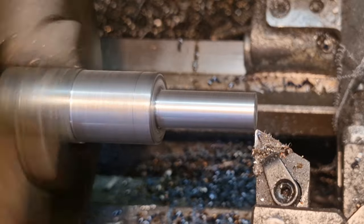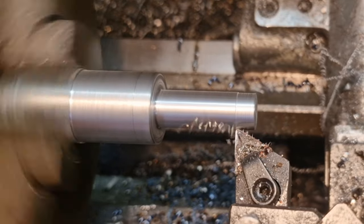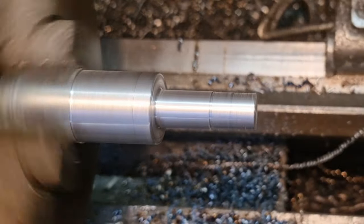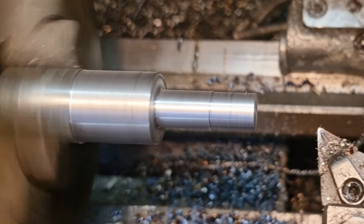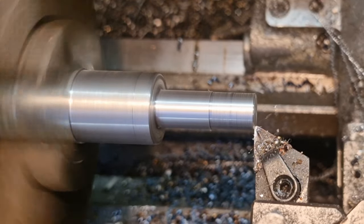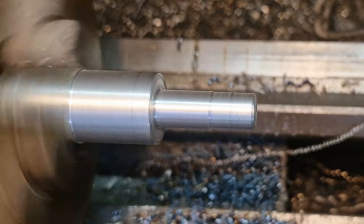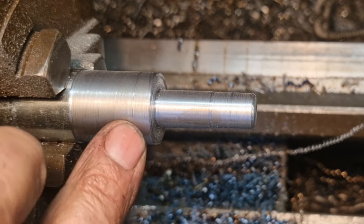Come on you bastard - down to 35mm, which is there. We'll break that edge while we've got it here, then take this next bit down to 12mm - just under, 11.9, I'm happy with that. That needs to go along for 16mm. Just a nice light little cut - we're not too fussed about the finish because we're going to cut a thread on top of it. 16 is there. Now we'll get a chamfer on - maybe a little bit more, to get the thread started.